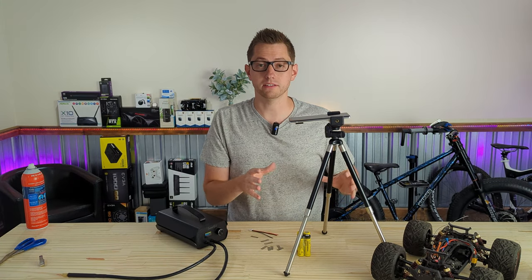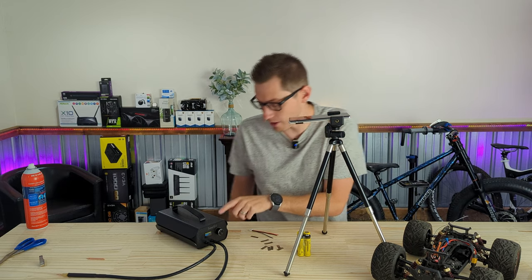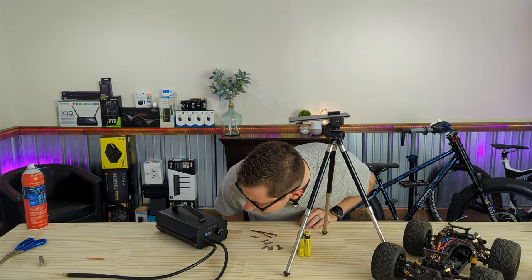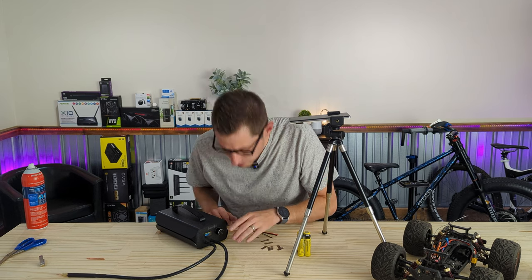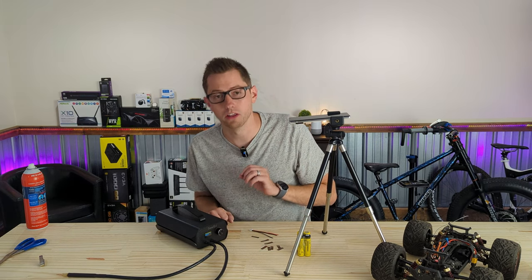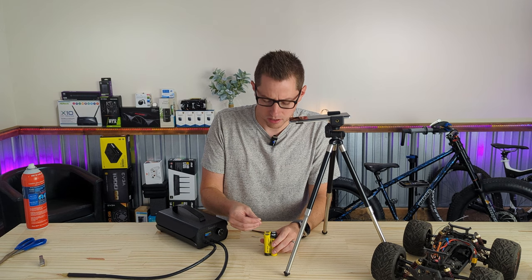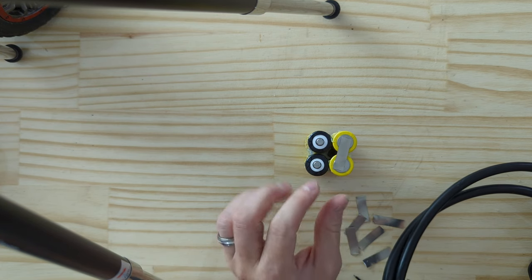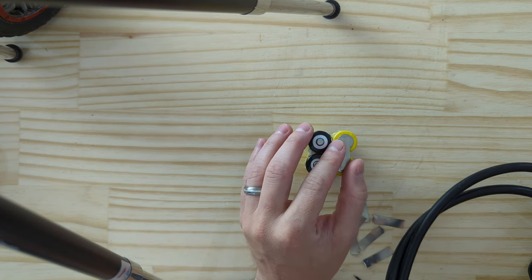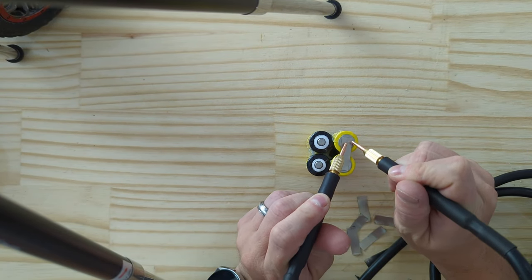I've got the camera down here so you can see a nice close-up. The capacitors inside the spot welder have been plugged in and charging for a while — they're up to 4.8 volts. For the first settings, I have it on a two-second delay at 75 on the power. I don't know why they call the power level 'gears' — if you guys know, let me know. I'm going to line my nickel strip up on one of the parallel connections.